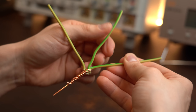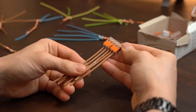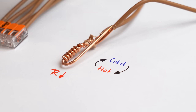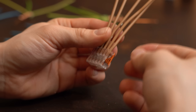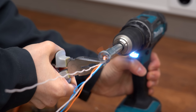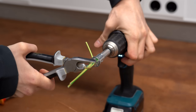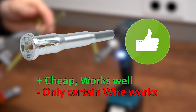I bet this connection method comes with a lower contact resistance than when using my favourite WAGO connectors. But I would still prefer using those because I feel like with enough heat and cold cycles this mechanical connection can lose a bit of tension, while the WAGO with its spring-loaded connector will always hold on tight. Also keep in mind that this twister tool does not work as well with stranded wire or wire that is too thin. In conclusion, WAGO is king, but this twister tool could be the next best thing — I kind of have to give it a thumbs up.